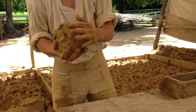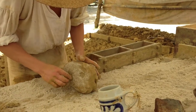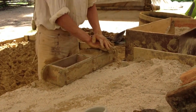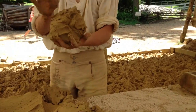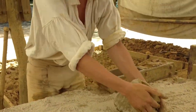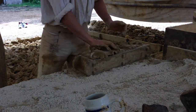That's the mold right here. We're making what are called coping bricks — those half-rounds. The reason you use a half-round brick on top of something like a brick fence is so it sheds water. You don't have to have a flat surface where water would collect on top; it simply runs down the side of the wall. So you just line them up all along the top of the wall and the water just has a place to run off. That's all that is.